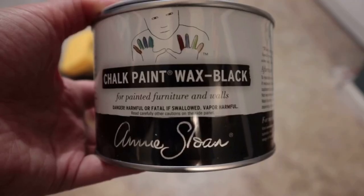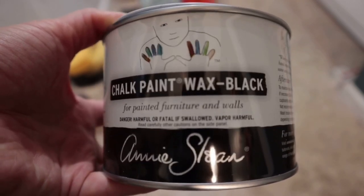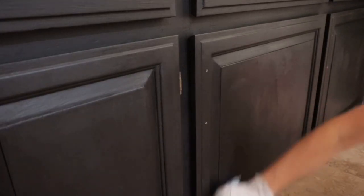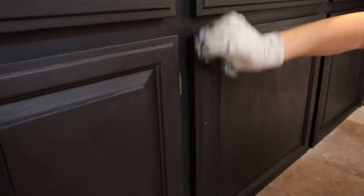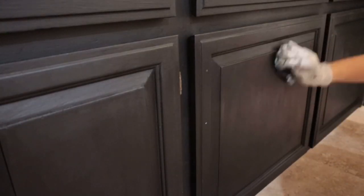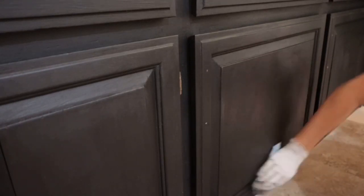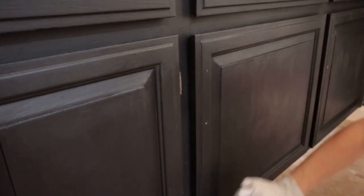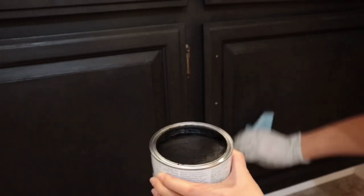The videos for the painting part were missing, but I did another project that also used the same color. I'll link it down in the description box for you. I ordered a set of knobs with an antique brass finish. I wanted to add knobs to all the cabinet doors. So I drilled the holes and then applied two coats of Annie Sloan's black wax with a shop towel, 24 hours between each coat.